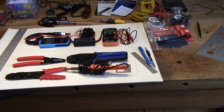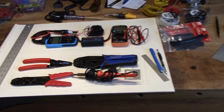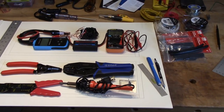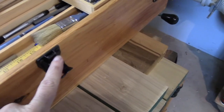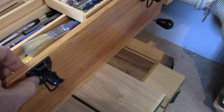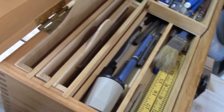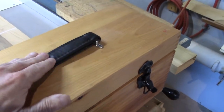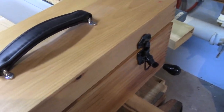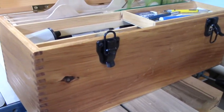So the plan is: one multimeter, a tool tray, and a lid that will capture the electronic test stuff. I'm going to go a half-inch thickness. It doesn't need to be less, but what I realized when I was looking at my drafting box was the hardware you need to screw in holds pretty securely with half-inch stock, and the hinges work well with half-inch stock too. I'm going to go with a fold-flat handle on the lid because it presses down flat when you need it but you can still pick up the box easily.